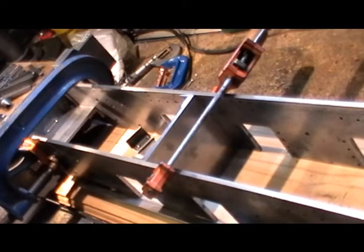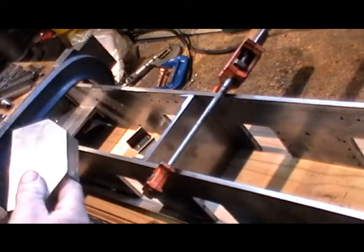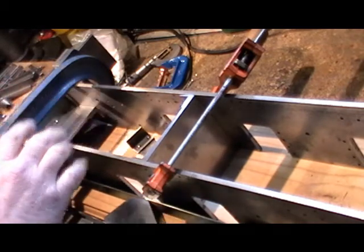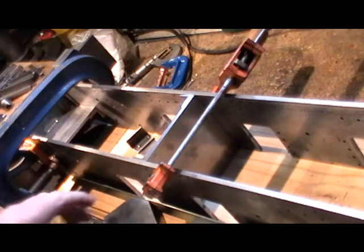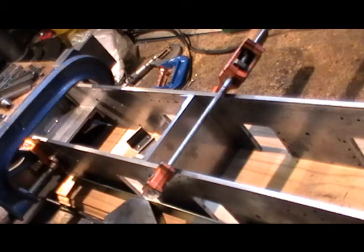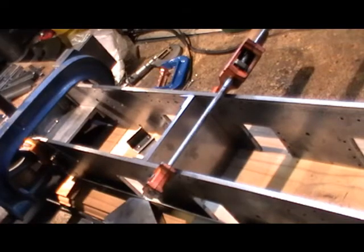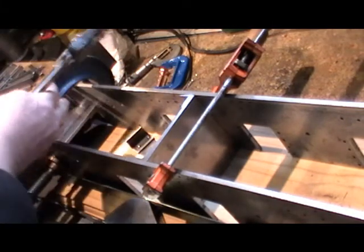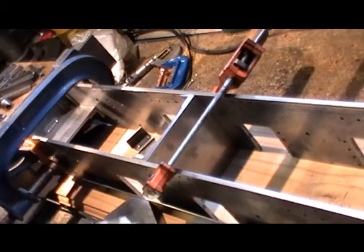So where I'm up to: I've got my stretcher here - this is the rear one and I've got the same one in the front. I've set the stretcher while I've got everything set up - I thought I might as well get that first stretcher in position to transfer holes, so I've got that one all set up. I've measured with my vernier caliper in all four corners to make sure it's dead flat from the top of the frame up to my buffer beam, and it's in the right position to transfer the holes.